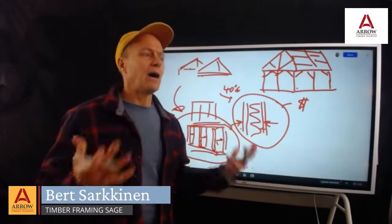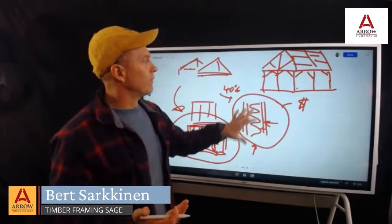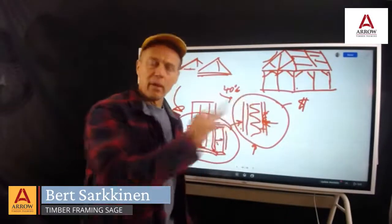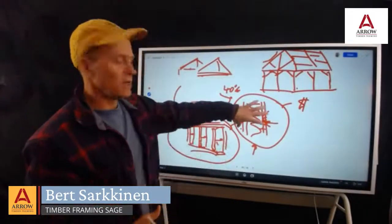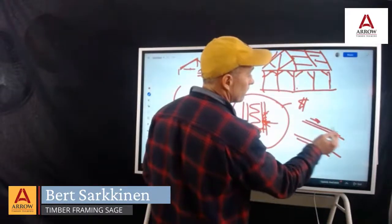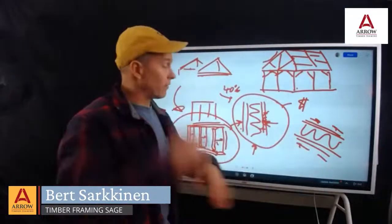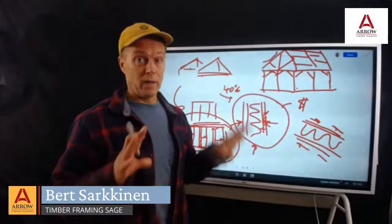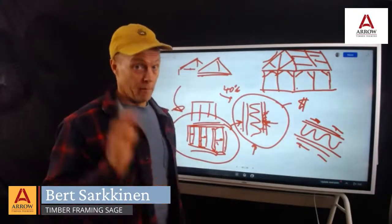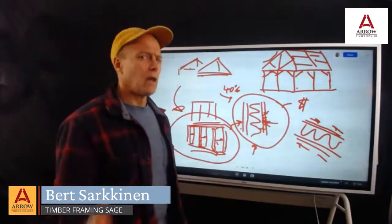And then the last thing, if I was making this decision, kind of a kicker for me is, say I have this SIP on a roof and the roofer makes a mistake and there's some water infiltration and I get rot on one of these panels on the plywood, well, that is kind of a big deal, because when the SIP is on the roof, it works like tension and compression, just like we've talked about. Top layer is compression, the bottom layer is tension, and that SIP is where that strength is at. It's just kind of like an I-beam. So if that half inch layer gets any sort of rot or weakens in any way, it's a big deal. It's not a matter of replace some sheathing and get it waterproof better and move on. You're taking the ceiling down, you're opening the structure up for the elements, and so on and so forth. So a little bit of the pros and cons there.